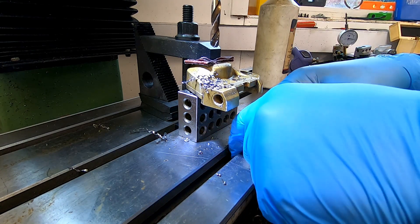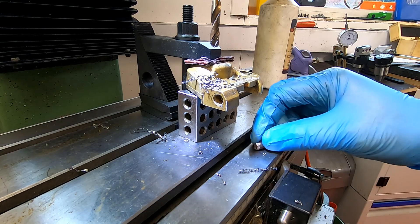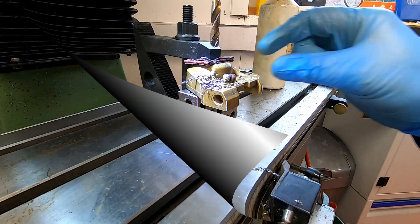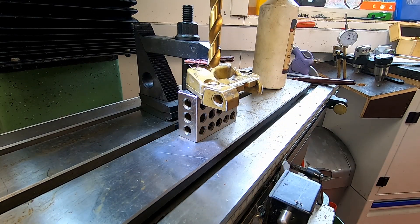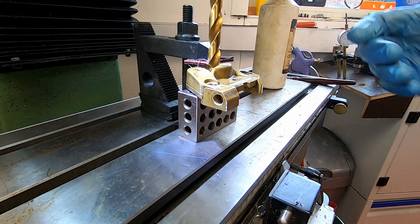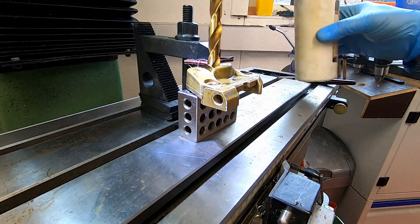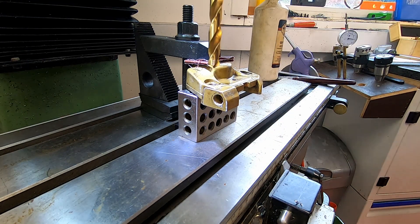There's the remains of the bolt that came out there. So this is now going to go in with our 10.8 millimeter drill for the correct tapping size. You'll also notice when I start the machine I've dropped the speed way down, because I want to be able to control it and get as accurate a hole as possible. I'm just going to use a little bit of cutting fluid on there.